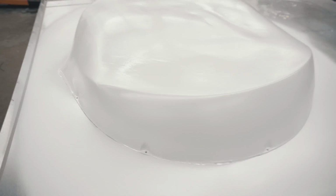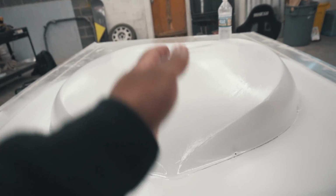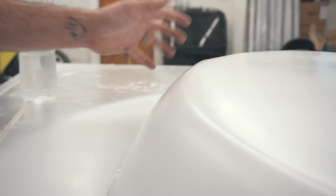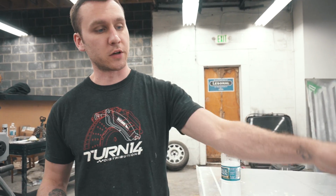Ooh, fresh primer. So how would you separate? You just cut it down the middle? When I sand, I'll make sure that this line, where you can see the edge of the part meets the edge of the plug, is visible, so you can see where to trim it. And then all of this area right here, we're going to use this stuff called filleting wax. It's smoothed in, as well as all of the old bolt holes. Wax all those shut, but we'll leave a little divot so you can see where to drill the hole and where to cut the flare.